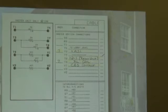Before I came here, yesterday I had a call from a guy. Something wasn't working. So I said, well, do you have a wire on, let's say, Tango 8 terminal? Yeah. Well, it's supposed to go there, right? You see it on the print? Yeah. Where's it going? He went there. There was no connection to the terminal on the main controller. He said, well, I guess it doesn't go there. It's not connected there. Well, what wire number was it?